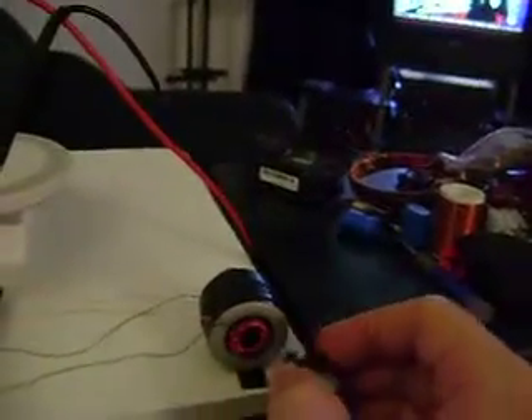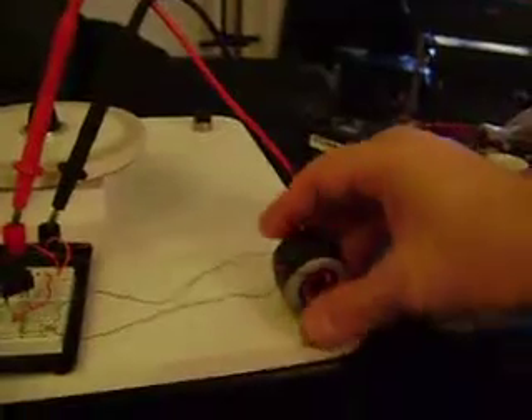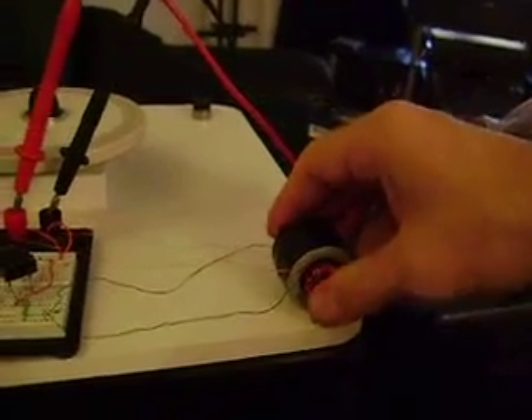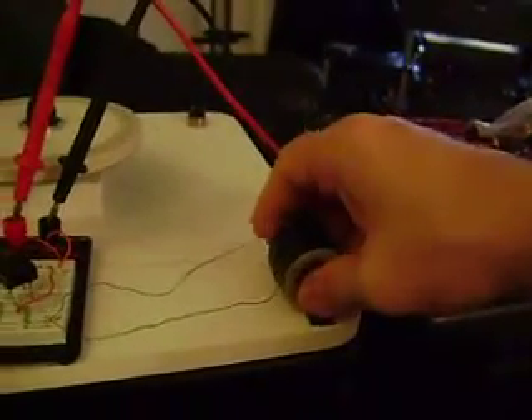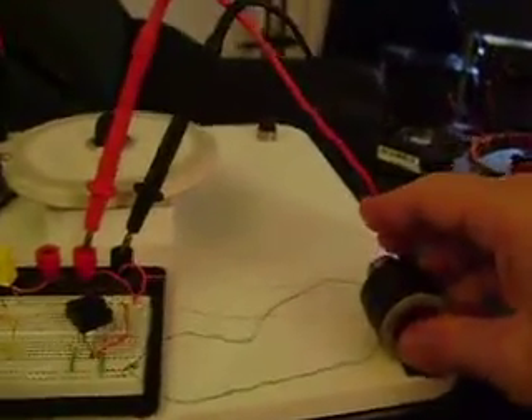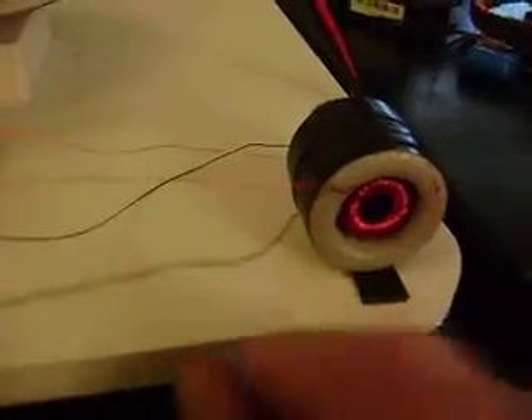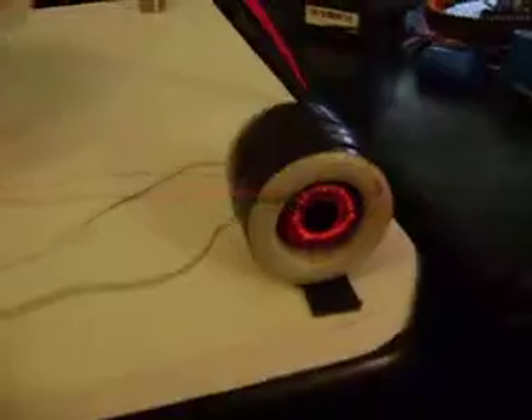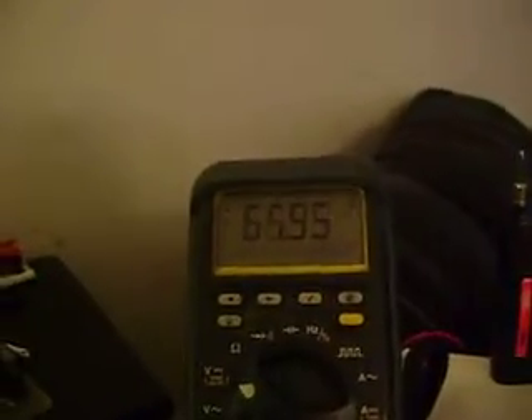So I've got to go with either some smaller magnets. Let's take this one off. For some reason I did get some better results from being on the other side, and this could be adjustable here — see what happens, you know, differences. These magnets are strong, they're dangerous. She's generating voltage and it's just got to be from the switching, going from here to here, across the secondary winding. So it's just a different way of doing it. Solid state — 68 volts.